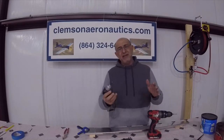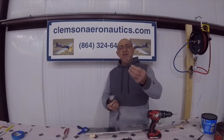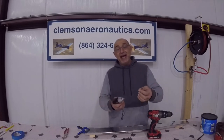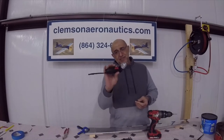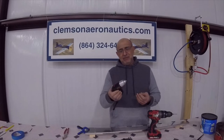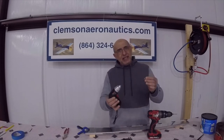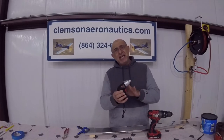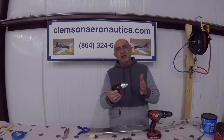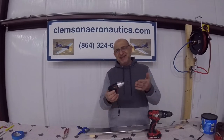The other thing I want to talk about is deburring. This deburring tool is from Cleveland Aircraft Tools — I just ran across their video today. They were recommending a cordless drill, except the one they had was very expensive. What's good about this drill is the RPM: 180 RPM, meaning it makes 3 revolutions per second. Just touch the material two-thirds of a second and you have 2 full turns to deburr the hole.